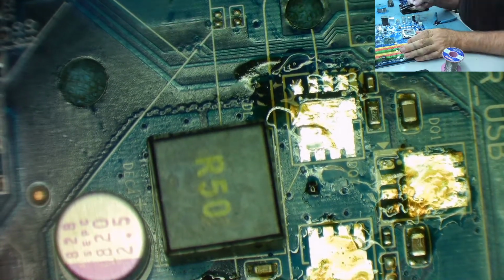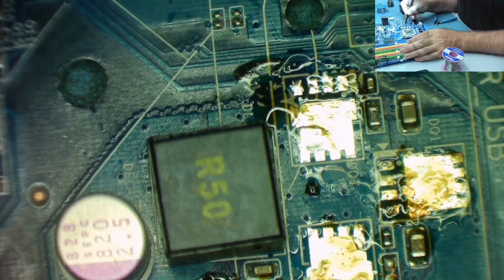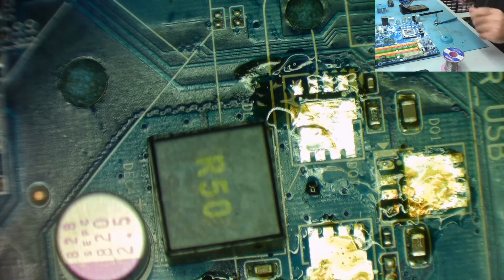fun's going to be getting this chip in here. This is the fiddliest place to get out. Yeah, this capacitor wants straightening up, but I'm sure it's in. So on the chip here, you can see there's a notch there. Yeah, so that indicates where pin 1 goes to the left of that, and then we count anti-clockwise.